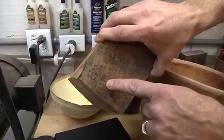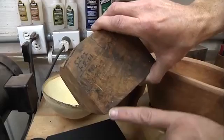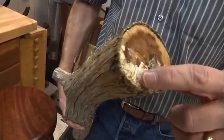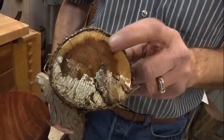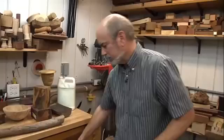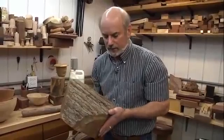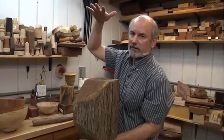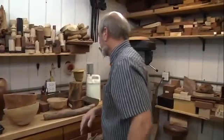This is a piece of cedar I've had out in the backyard for quite a while. You can see fungal growth and some mold, and the wood's getting dark in there. You can do some cool tricks with green wood — take a log and just stick it right in contact with the dirt and leave it for a month or so. By doing that, you get what we call spalting in the wood. Spalting creates these beautiful patterns — incredible looking stuff once you get it finished. That's what makes ugly wood beautiful.